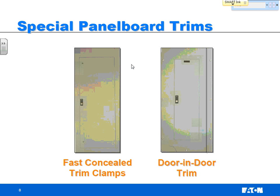And you used to always see a plastic protector that people would put over there, or a piece of cardboard that was very common to cover the currents, because the electrician has that energized to make sure his load's hooked up. His loads aren't exactly in the same room. He may have to walk over to the next room. So if he's got his panel board energized, he's walked in the next room to make sure his load's connected, and his buddy walks in, if everything's exposed, it's a very dangerous situation that OSHA frowns upon.